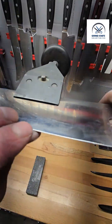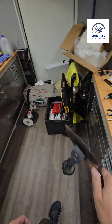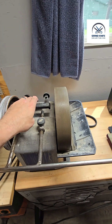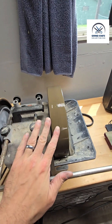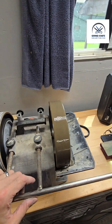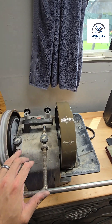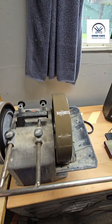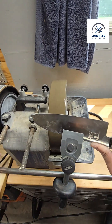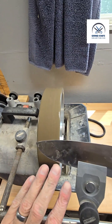We've got some deformation here, little chips, and all kinds of fun stuff. We'll come over to our 100 grit wheel and get started. These are made to run in water — they are pretty easy to maintain. Don't leave them in water for weeks on end, but you can use them in water daily; they don't need any additives. I always say take the water trough off at the end of the night so they can dry out — that's your best bet.